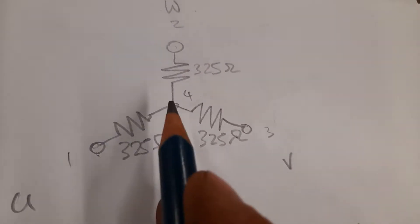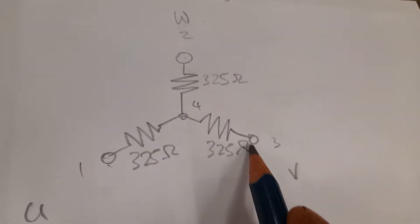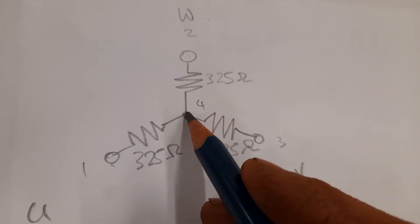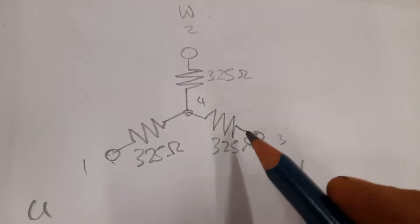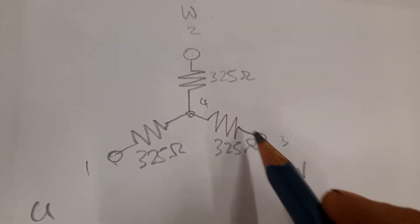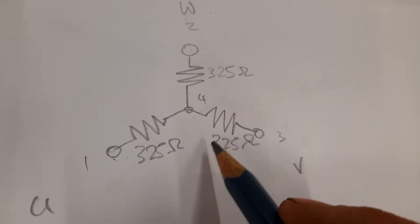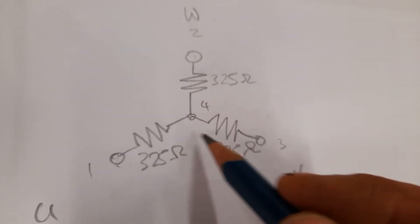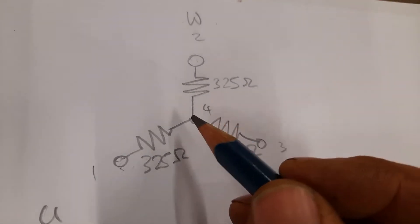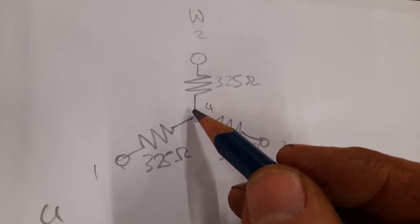It's very easy to test with a multimeter. I went from the star point — those three common wires — and checked the resistance: I found 325 ohms. Keeping on that common point I checked the other windings and sure enough all three were identical. Of course if you have two resistances in series you'd have their sum — 650 ohms — and sure enough that confirmed what I was expecting. Then I broke that star by taking those three wires off the post.